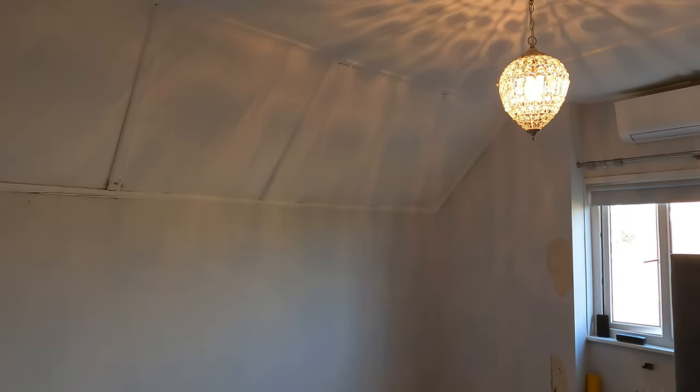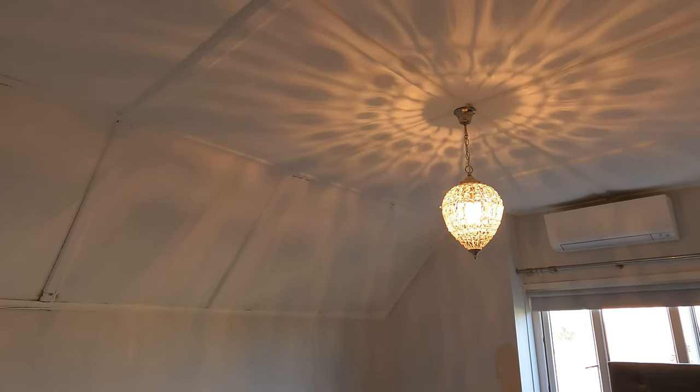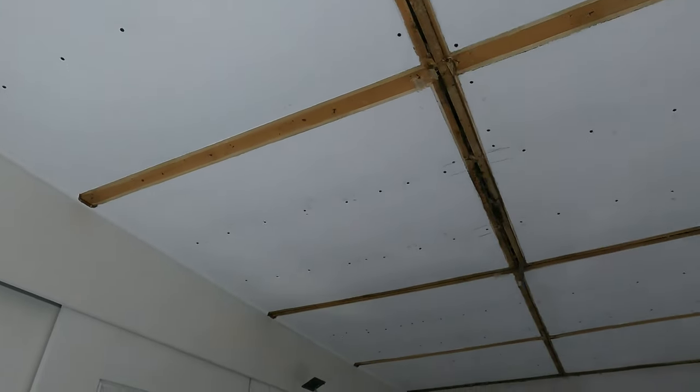You've probably done these before - this kind of feature ceiling in these houses is basically hardboard with just timber slats across where all the joints are in the hardboard. They tend to bow and get completely out of shape. You can remove just the slats and board over the hardboard as long as you make sure it's crossed up flat.